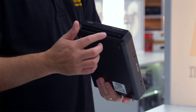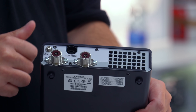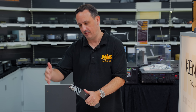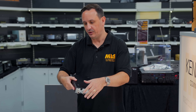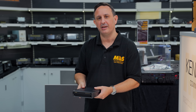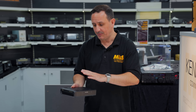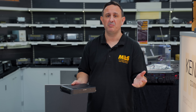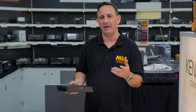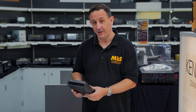There's absolutely nothing on the front at all. On the back we've got our SO-239 inputs and outputs and a controller cable which links to your FT-891. The patch lead goes from the tuner to the radio, then off your coax to your antenna. You can either mount the radio on top or have it separate — I like to see it mounted on top so you've got one small package. Assign a tuner in your menu, hit tune, and away you go. It works, it will tune most antennas you're going to use when out and about portable. The FC-50 is the one to go for.